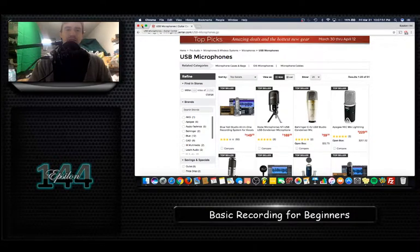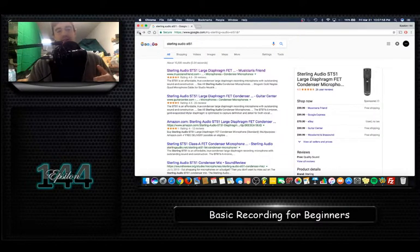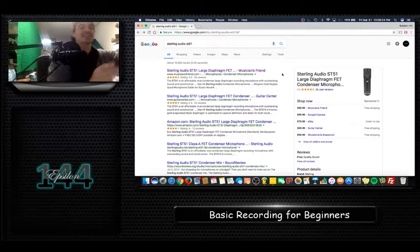So now going back to what I have here, if you do have an audio interface, you can use anything that's XLR, audio like this. You're going to plug this XLR, which looks like this at the other end, these three little prongs, or three connectors, into the audio interface, and then it goes into the bottom of your XLR. This is a different one, so my voice is still working. If you're wondering why my voice hasn't cut out because I unplugged it, this is for the keyboard, so it's not for the microphone.